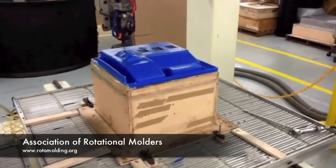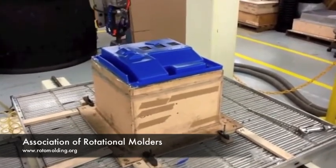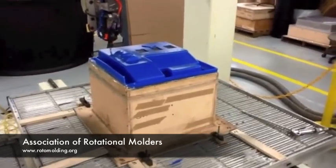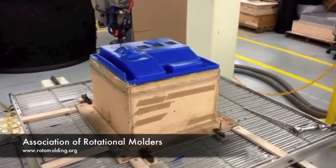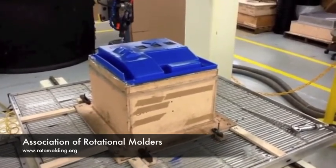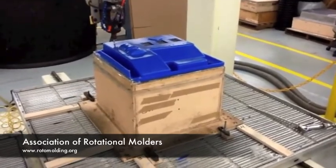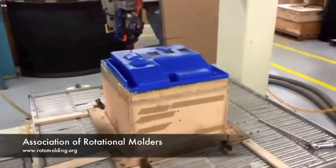The 1/8 cutter right now is putting in holes about 200 thousandths in diameter. If we had a tool changer on this machine, we would just have a drill come out and actually drill the holes so we would not have to route each one of them.